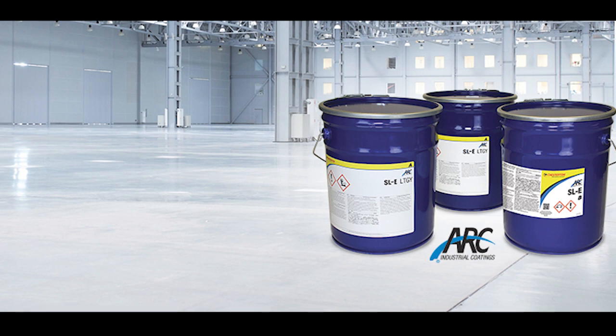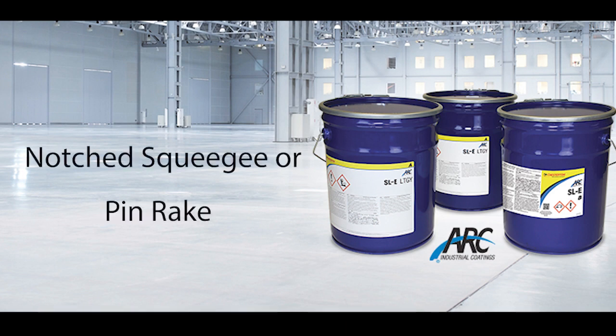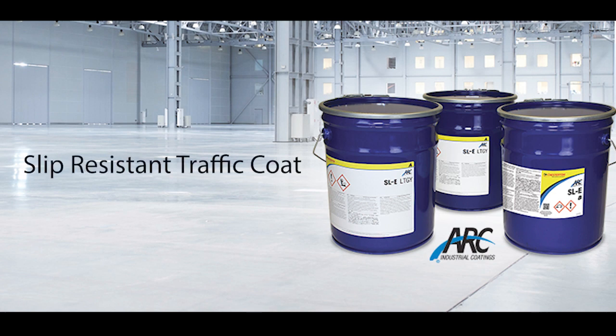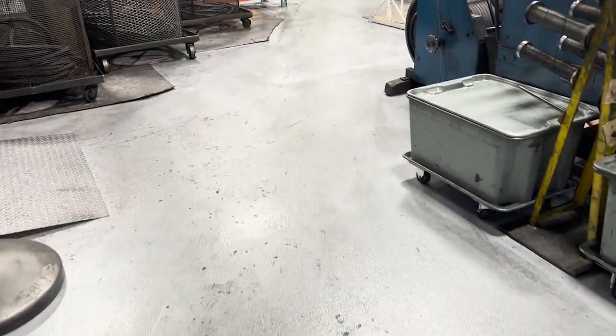The self-leveling features of SLE as well as the ease of mixing allow for fast and easy application. ARC SLE can be applied as three different systems: one, a roller or squeegee applied 15 to 20 mil epoxy sealer for traffic striping; two, a notched squeegee or pin rake applied self-leveling coat at 50 to 120 mils; three, a slip resistant traffic coat comprised of a 20 to 30 mil squeegee applied coat into which a broadcast of BA-1 30 to 50 mesh silica sand is cast, which can be top coat sealed to aid in floor cleaning. This third version is what was applied.